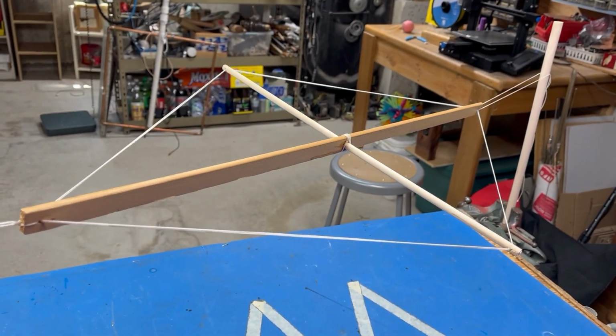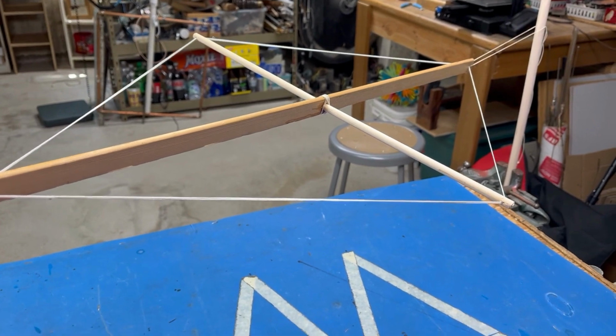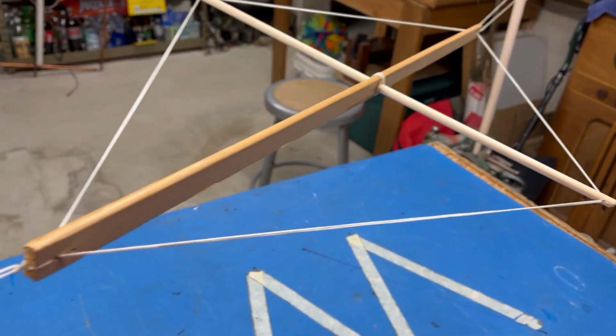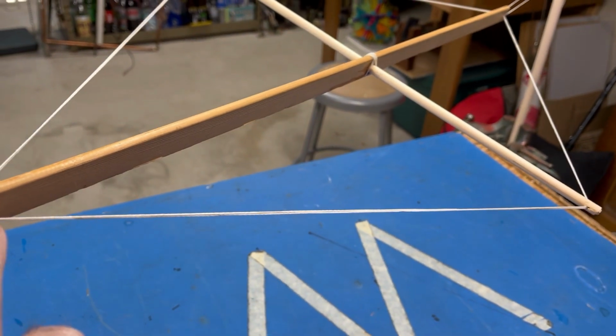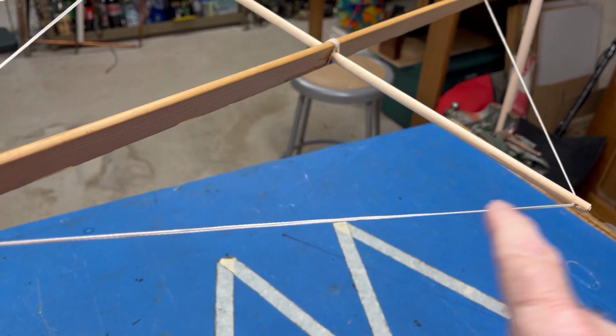from 80 megahertz all the way up to 150. And you'll see how the lobes and things start to come together. Really, really quickly, right here on this wire, this is four wavelengths long. So at 2 meters, we say 6 feet, roughly 25 feet.